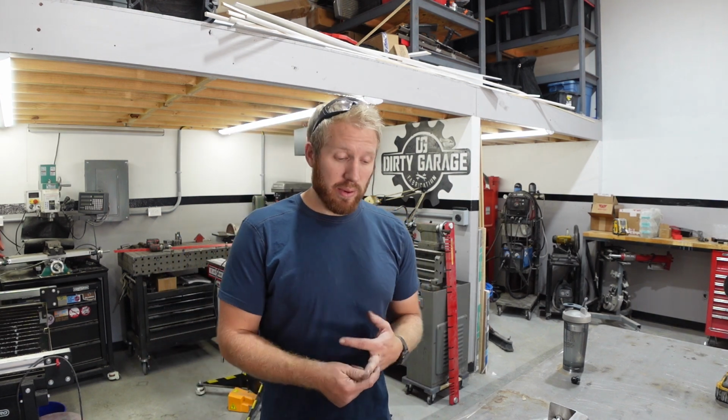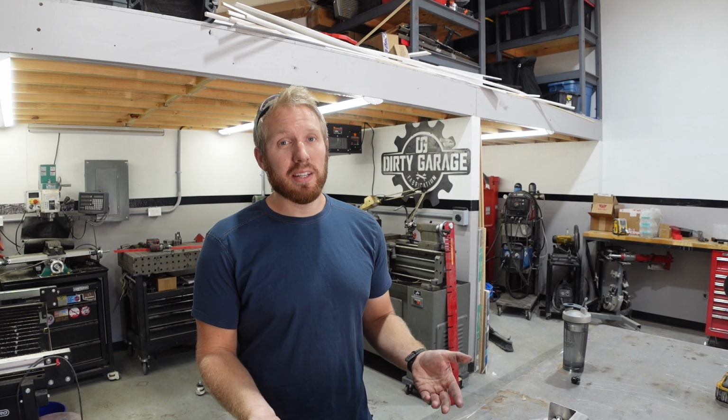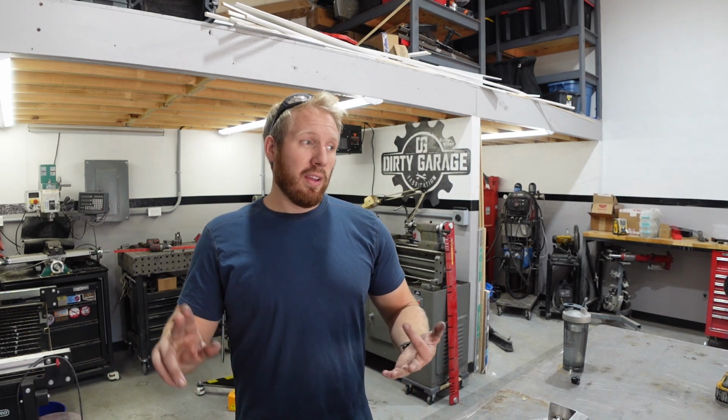One of those things that I normally check but didn't, because I kind of got frustrated that I lost all the design the first time I did it, was the stock that I needed to make that big cut. And then we ran into the X-axis crashing and then messing up that cut, so it was wasted aluminum. A couple hours wasted trying to figure out what was wrong.